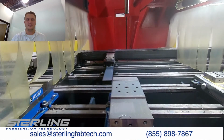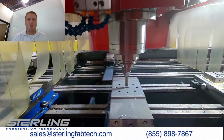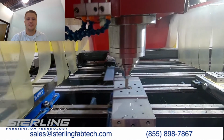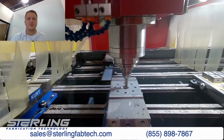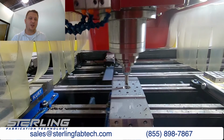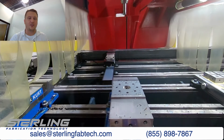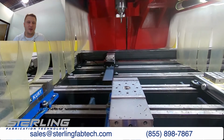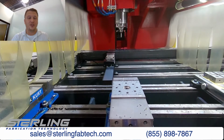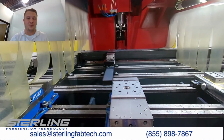There you go. And while we have this running, Jason, let's pull you back in, man. So you're obviously a plasma as well as a laser guy. Let's talk about maybe your feelings between the FlexCNC and how it can actually complement the plasma and the laser machine. Yeah, sure. Kind of going back to the tube laser that we talked about, there's just a lot of features like what you guys just showed right there. Obviously you can't do that on a laser, or some of the countersinking and tapping and whatnot. So if you've got a lot of drilled holes, especially in thicker materials where your pierce times might be a little bit longer, the laser or the plasma is definitely great for blanking out the parts.